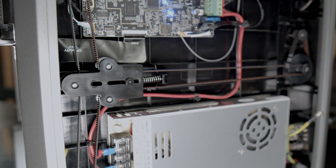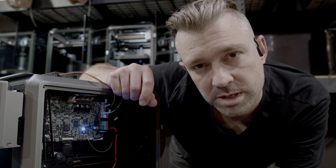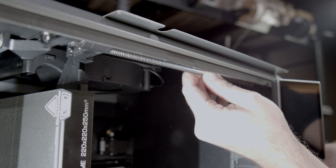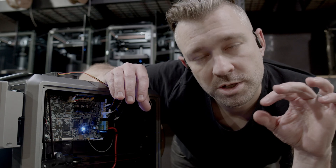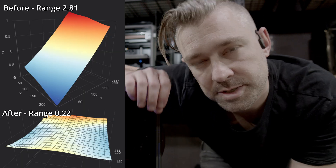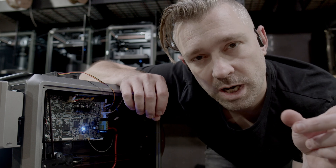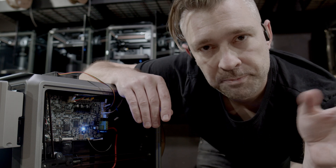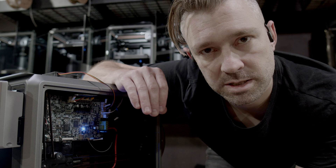Before we can rotate the Z screws by hand, we need to compress the belt tensioner — this will allow us to more easily rotate the Z screws. Since this bed is at a 2.8, I'm going to rotate the front Z screws clockwise to move the bed up, doing this slowly and running another bed mesh. Generally I pop one or two teeth at a time. If you're doing this for the first time, try to jump one tooth at a time, as you don't know how fast you're going to move the bed up or down — just be patient and run a few bed meshes as you go. Now that the bed is at a range of 0.22, I'm going to call it good here. The teeth give you a limited range, so you can over-jump or under-jump; at this printer 0.22 is about as close as we're going to get.